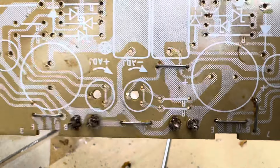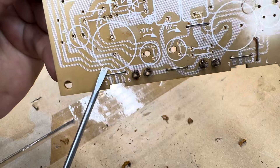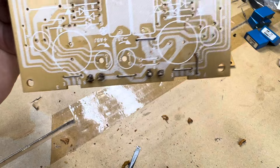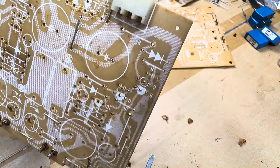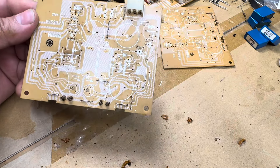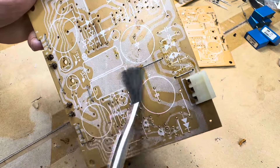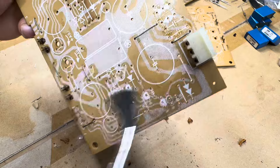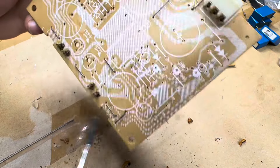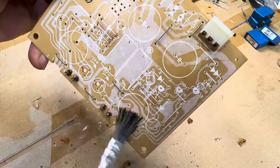Again, the goal was not to scratch the silkscreen. If you have anything left you can clean it after. For the remaining residue I use a little bit of acetone — so here's an acetone brush — and that takes care of the heavy stuff. Then ultimately at the end I hit it with some 99% denatured alcohol, which takes all the residue out.